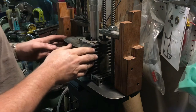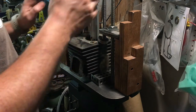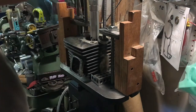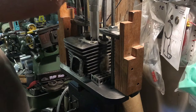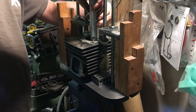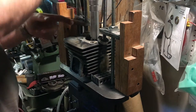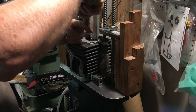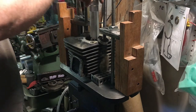The clamps are set up but loose, so we can give it a wiggle to let it find its home. Put a little tension on each side and tune it in. Pull the centering cone off and re-clock it just a little, then tighten up again — watch if the quill moves over. If it does, you're not centered. That looks pretty good.